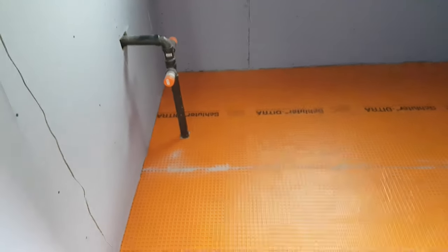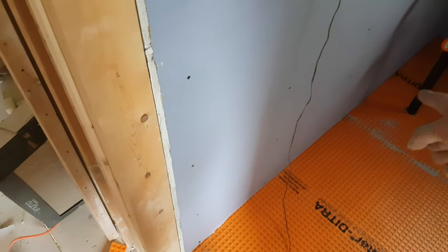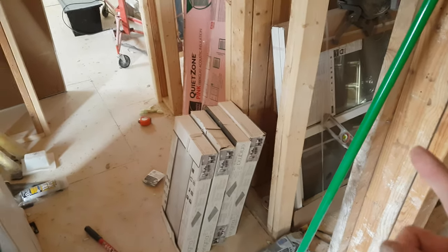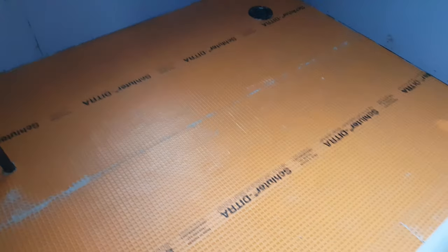Tomorrow I'll lay out the tiles and cut them. That right there is a wet tile saw. I'm going to copy the approach of using the tile as the border. This stuff is 12 inches wide by 24 inches long — the other stuff was 6 by 18 — so I'll have to cut basically an entire box of these in half up the middle to achieve a 6-inch border. I think 6 inches is just easier to stick with.